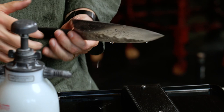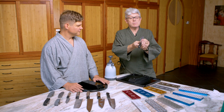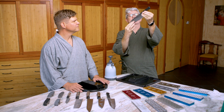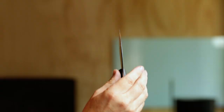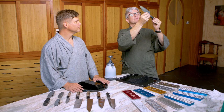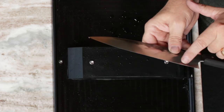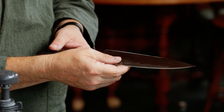I'll get it wet and wipe it down. It's a beautiful clean knife so there's not too much to do. I'm going to sight down it, make sure the knife is nice and straight — of course it is. I'm going to look at the spine; it's just beautiful. Now I'm going to look at the line of the knife. It's nice if you have a white back wall — you can really see the line and if there are any divots, dips, high points, or chips. In this one I see a tiny high spot right here and a little bit of a high spot here, so we'll take that out in profiling just a little later.